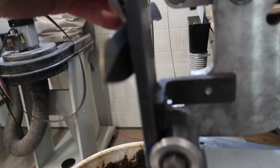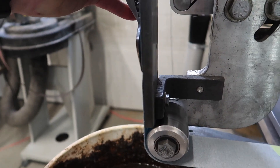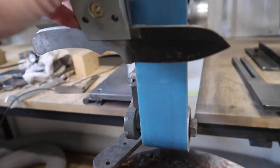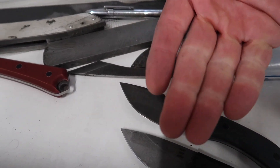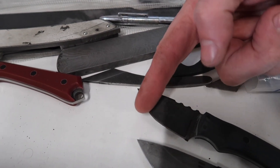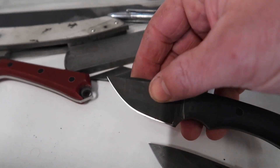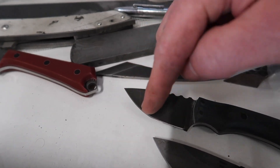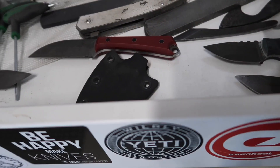You sharpen it up, flip it over, sharpen it up - that is cool. I think this is gonna be awesome. For small knives and knives that have a lot of curve though - I tried a bunch of scrap knives yesterday and the angle changes so much. We've got a nice gradual angle, probably around 20 degrees, but by the time you get to the tip you're probably at about 30 degrees for your secondary bevel. It's sharp and it works, but the bevel doesn't look consistent.